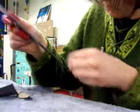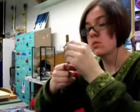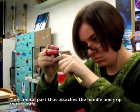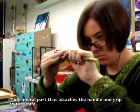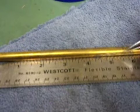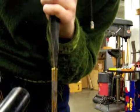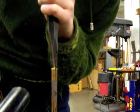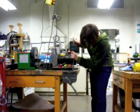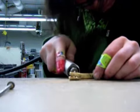After the blades are polished, this is when we'll separate the blades. Because of the way the blades were constructed, they didn't have a tang attached to them, so it would have to be built separately and then soldered onto the blades. The tang is built using a piece of round brass, the bandsaw, and a chisel. Sometimes the brass needs a bit of encouragement. It takes a bit of jerry-rigging, but eventually your tang is formed. Then it's merely fitting and clean-up work.